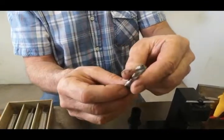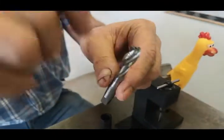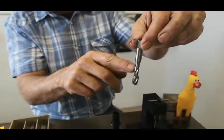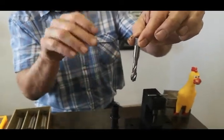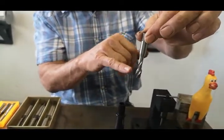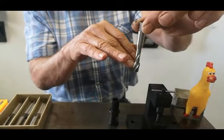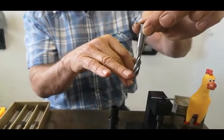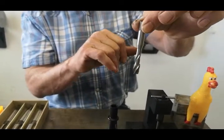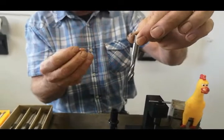Spiral flute — self-explanatory. You can see the flute, and in the spiral flute as it cuts, it throws the shaving back. You'll find when you're tapping in a downward direction, the shavings come out the top. Lovely taps. It means you can go into blind holes, but you can't go too deep because it can start clogging. By hand, you can often feel if it's clogging up, but by machine it's a little bit tricky. I generally say no deeper than the full thread in one pass. With brass and other materials you can go a lot deeper, because you're getting fine chips and little shavings.